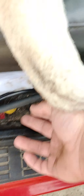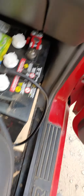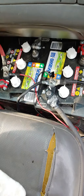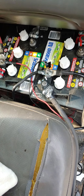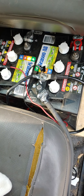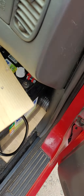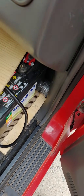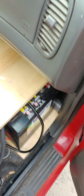The cabling comes up through the floorboard to my two golf cart batteries. These are six volt, 250 amp hour batteries, and I wired them together to make a 12 volt system. That gives me 500 amp hours total, but batteries only let you use 50 percent at any given time, so I really only have 250 usable amp hours.